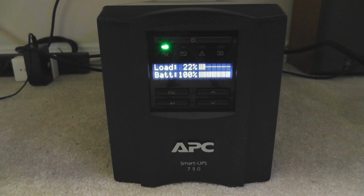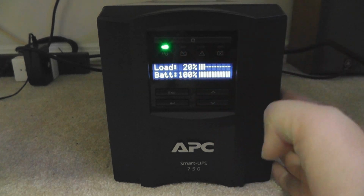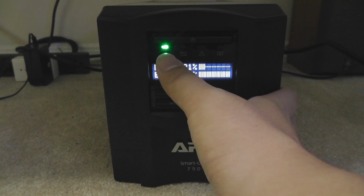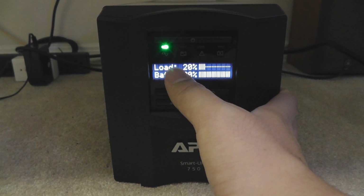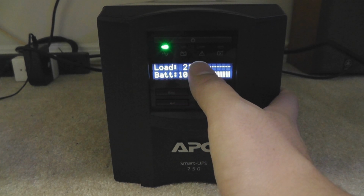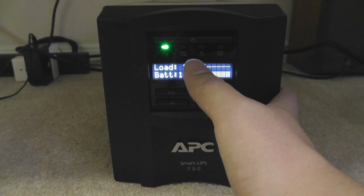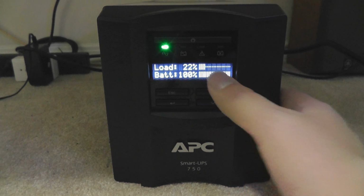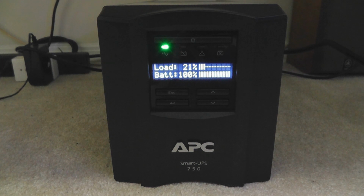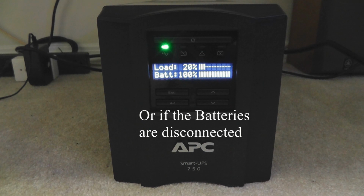Because there are a few things you want to pay attention to just after you replace the battery inside your UPS. But first, let's go through the buttons so I can navigate through the menus. The first button, the large one, is the power button. You can use it to turn on or off your UPS. The first light indicates online, which indicates you are connected to an AC outlet. The second one is on battery, when your AC outlet is not working or it's doing some kind of a test, when it's actually draining power from the battery. The third one is a general warning light, which will indicate any kind of problem you have with the UPS. Except when the fourth light is on, which is the battery warning light, when the battery has a related issue, which most likely means you need a replacement battery.